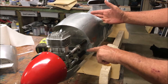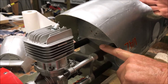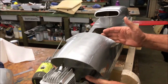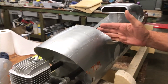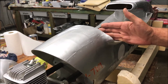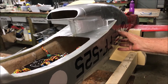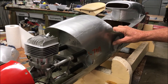We won't need all four steel standoffs — we'll probably come down to one or two and replace the others with aluminium once we get the wing on and check the balance. We need tail weight to balance all the front weight. Many people say all those servos down the back are a problem, but we were going to be adding weight anyway — the batteries have to end up coming right down the back. All up, it's about 13 kilos flying weight, which is just nice.